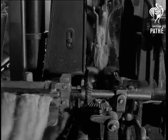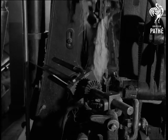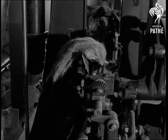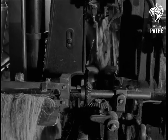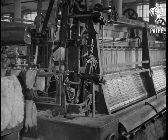They are now passing into the part of the machine where the combing or hackling is done. Only one leg of the U is dealt with at first. The other is combed later. Coming along from the left, the pieces turn at right angles and then pass between a series of steel combs on moving belts.